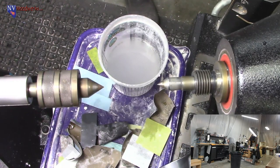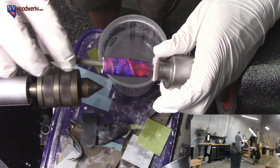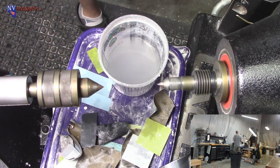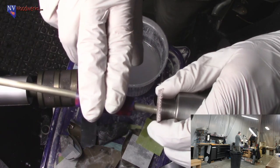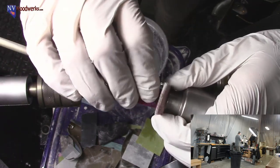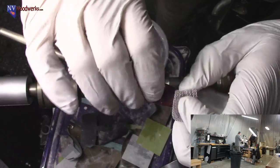What I do is I just use a pen turning mandrel with a piece of sandpaper on it. You could maybe use bushings and stuff, and figure out some sort of a system to use this, but I find that if you just hold it down and spin this thing around, keeping the tube riding along the shaft, then it's going to be perpendicular. It's not like we're really doing a lot of sanding, but you just want to get that end of it. Make sure there's no material hanging off